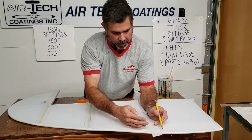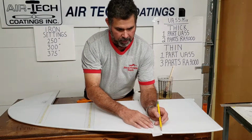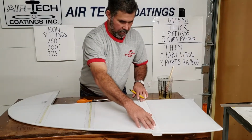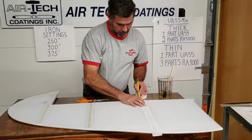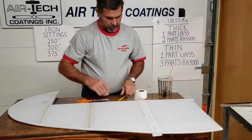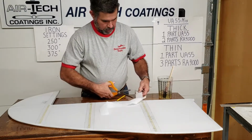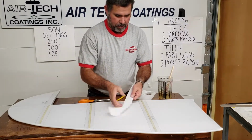Whatever this angle is, you don't want to come up here just with a straight edge and lay it and start. It'd be fine, be legal, but it just wouldn't look all finished as doing it this way. Lay in that corner, and I usually just go ahead and leave it down and come up here and say if I'm going to come right around the edge of the post, or wherever I decide to terminate this, put a mark there. Go ahead and get your pinking shears and cut that off and get that ready. All right, you've got this piece ready to go on.